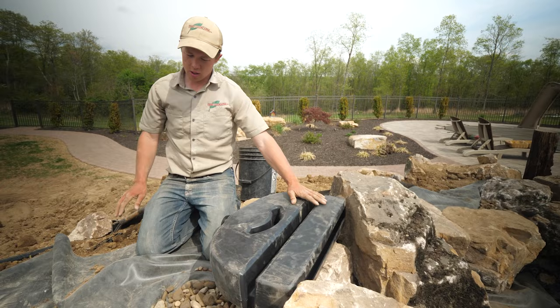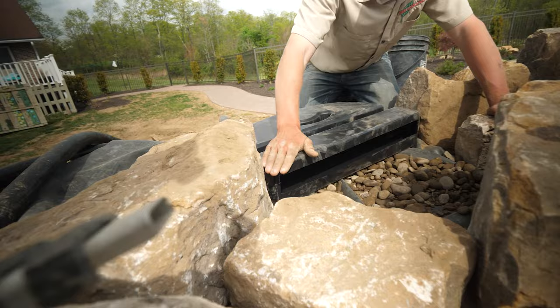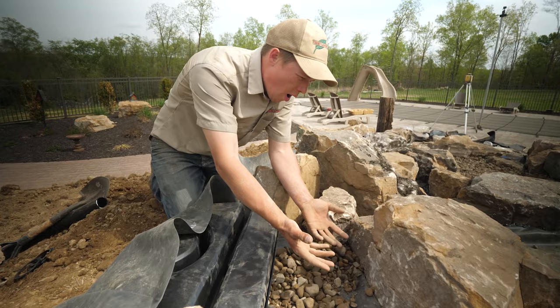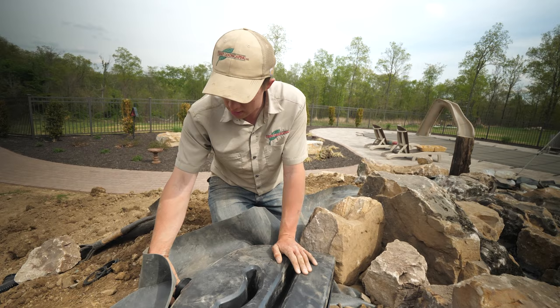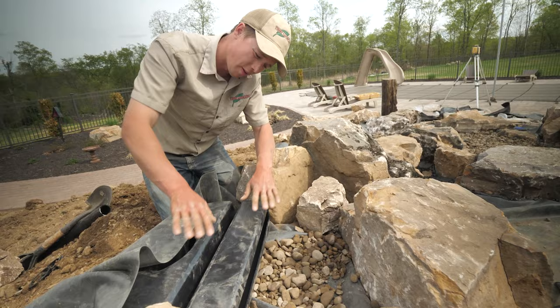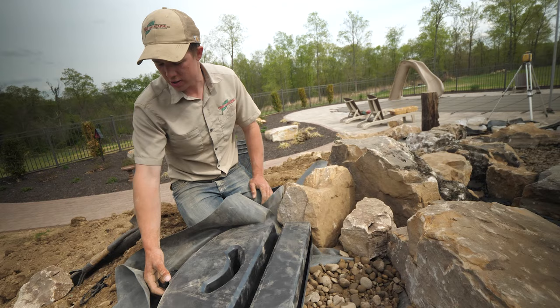What you can do is move the spillway way back here. I actually build a little pool here so the top of the spillway is level with here, and I'll put my bulkhead on it — I'll show you how to do that. The liner comes all the way up here and I'll even put a rock across the top so it's completely hidden and the water just wells up from the bottom and spills out over the top — it's sunken and out of sight. These things, if you do them right, are completely watertight. This area gets all foamed off, sealed off, and the liner back here is going to be higher than the spillways everywhere except around this bulkhead, which I'll do properly so it won't leak.